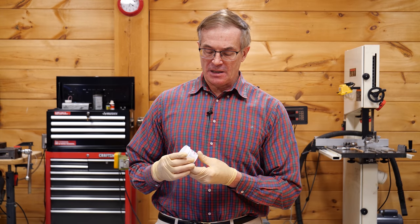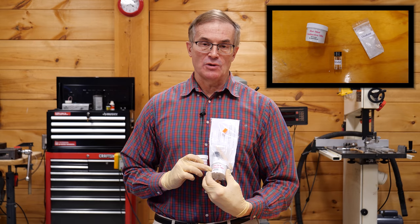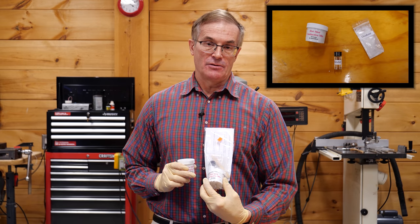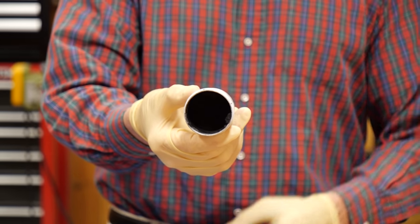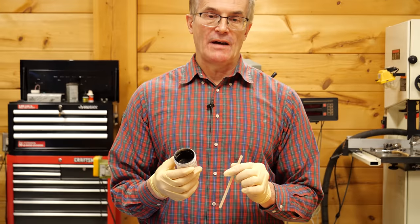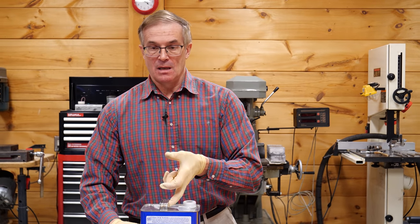Now the thing is, though, you can make these yourself. The way I've done this is rather than fabricating my own material, I got a kit from a company called Quick Burst — it's called Hot Shot. This kit consists of a small container with some carbon black, a binder which I believe is an acrylic resin, and a packet of oxidizer. You mix all these together and add acetone to create a thin slurry that you can place on the end of your bridge wire. This stuff becomes very rigid because the acetone, even in a sealed container, will quickly evaporate. That's not a problem though, because you can re-energize it as many times as you want by simply adding some fresh acetone.